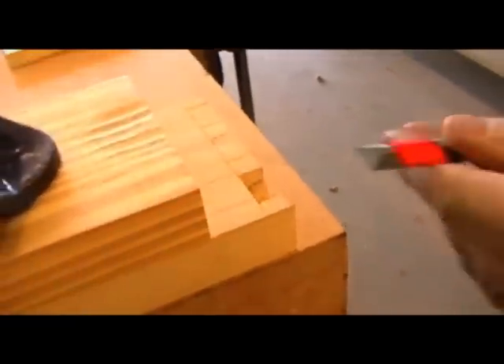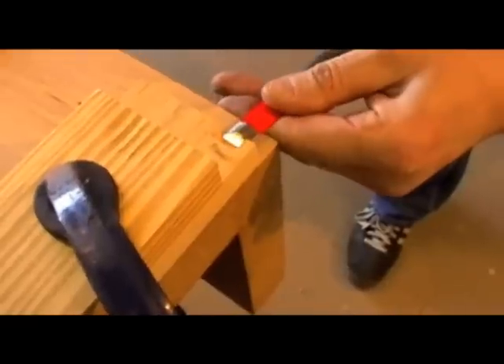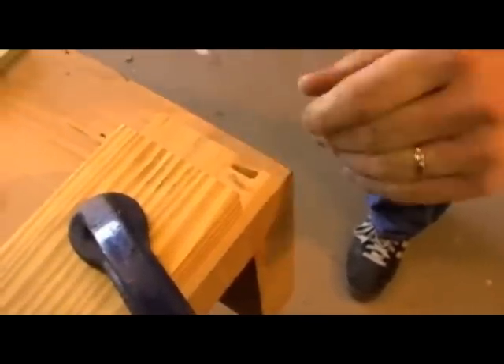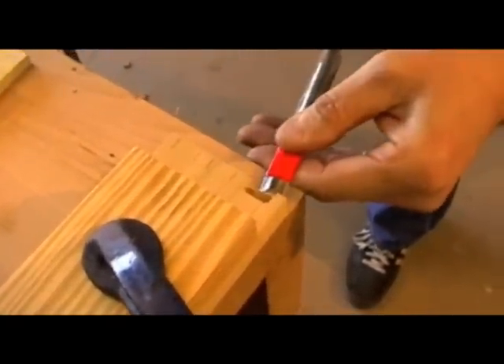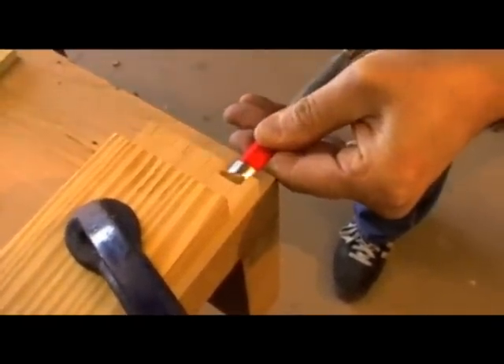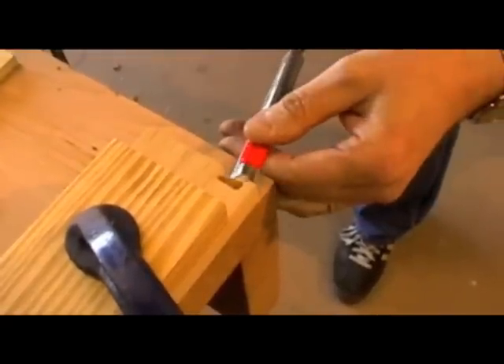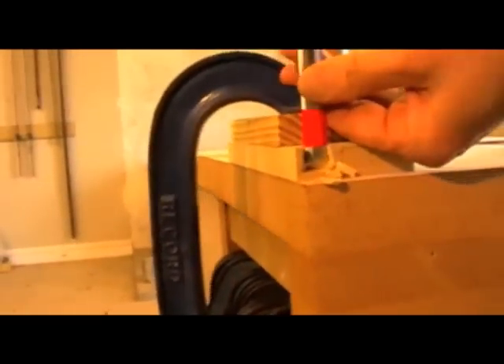Pick some of the bits out with your finger. I'm going to use that same chisel to remove the scrap from here — flat side of the chisel down towards the line of my cutting gauge. This is a bit more tricky than the through dovetail as we're working into a blind corner. I'm going to have to get a bit more chisel work in there to really clean those out. You can see the majority of the timber is now out of there. To make those sockets nice and clean, I'm going to have to get my smaller chisel — I'll just run down this angle in the corner.